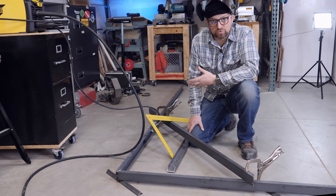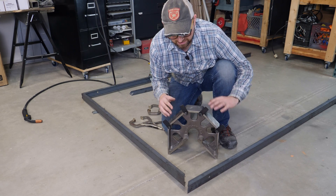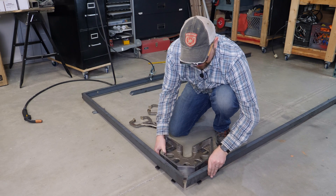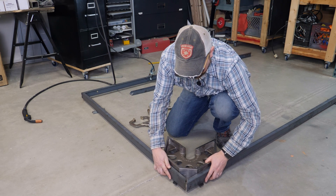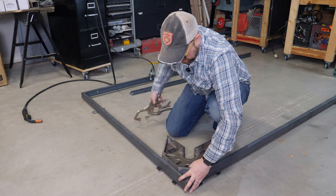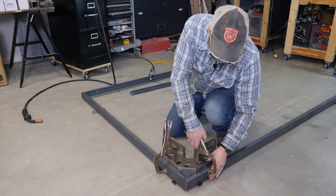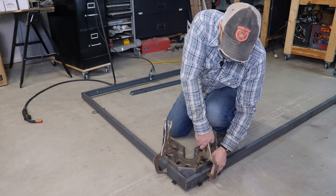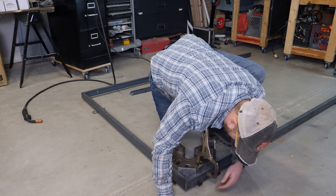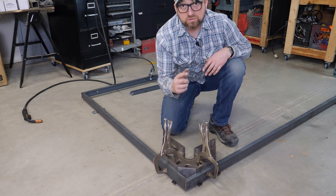I have the Fireball square set up so I'll put it on the inside of the trailer frame, put the two pieces on like this, square them up, grab my clamps, check to make sure everything's sitting level — and we are good just like that. I'm ready to go, I know it's square, and I'm going to put two tacks in there.